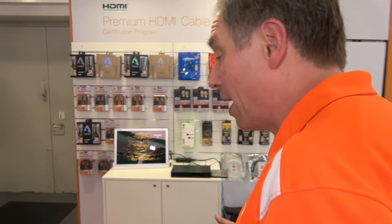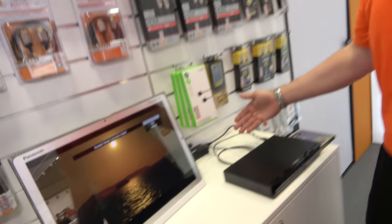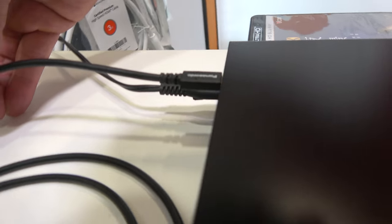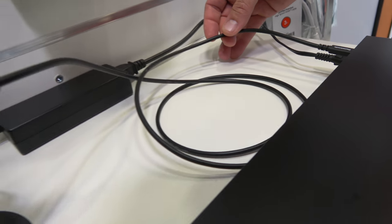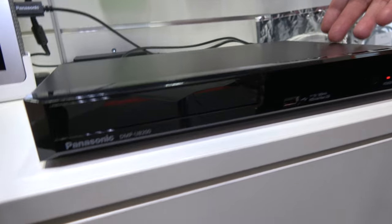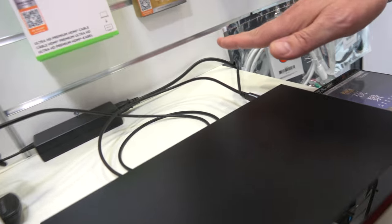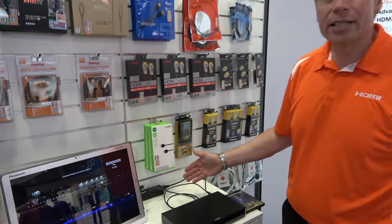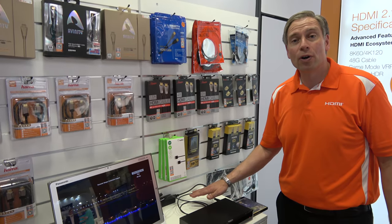And you can support all the specs of HDMI. Over here we have a prototype. We wanted to demonstrate that the USB Type-C to HDMI cables can be premium cable certified, which guarantees they will work at 4K60. Here we've modified an Ultra HD Blu-ray player — which is very simple to do, it already has HDMI out — we just put the Type-C connector on there, and we can show 4K60 content playing over a HDMI premium cable certified USB Type-C to HDMI cable.